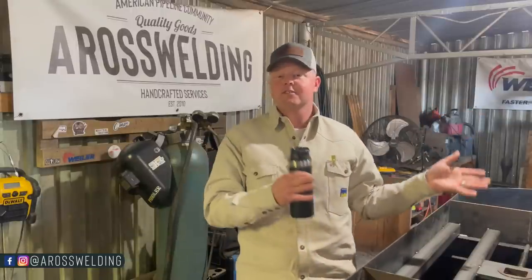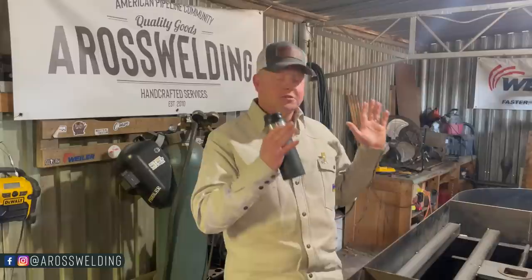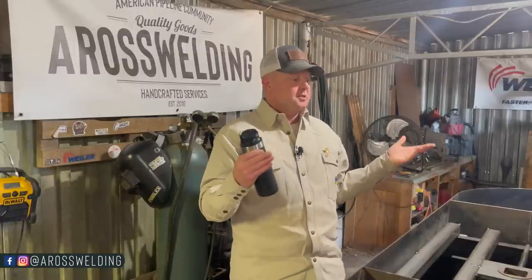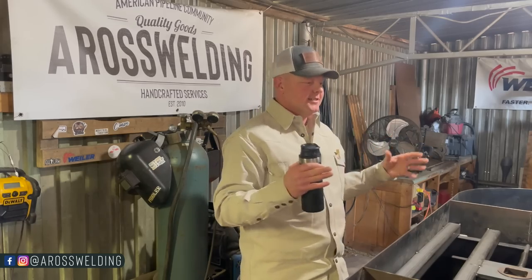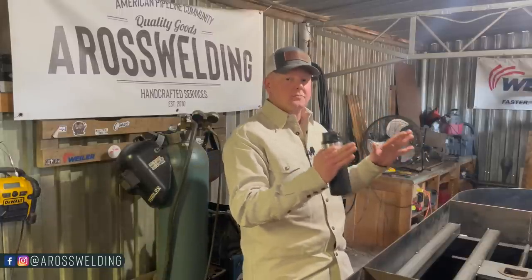So the main thing that I learned on this frame of this bed build was, like I said earlier, what I had to finally do rather than overthinking it was just get something bolted down, whether it was lengthways, crossways, whatever, just get something bolted down, that way you have something to weld to. I think, or at least in my mind, that was the simplest way that I could simplify it when trying to help others like yourself: when you go to build a bed, don't overthink it. It's always good to look at a flatbed or any other bed to see what they did. That's obviously the best thing we can all do when you go to build a bed. But to simplify it, for me anyway, whenever you're trying to do something custom like this, I just had to think to myself, just get something bolted down so you have something to weld to. I kind of look at it as like a clean canvas, a clean slate. Just get something bolted down and then just start fabricating to those main members that you've got bolted down.